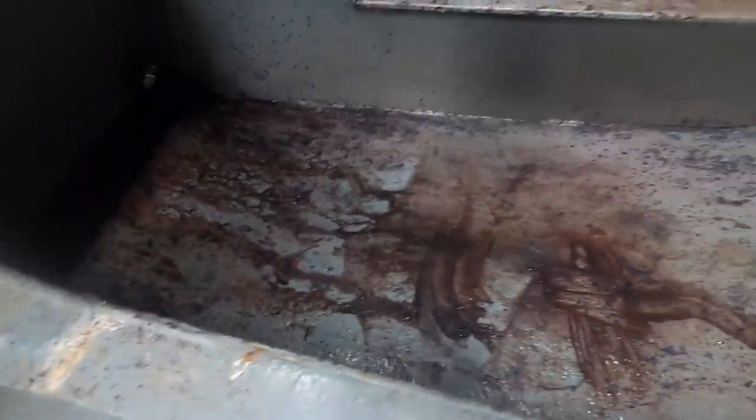Interestingly, after this storm, there's a whole lot of really nasty, sooty, black gunk in my bilge. As far as I can tell, it's come from the air intakes, which are well up high above the wheelhouse.